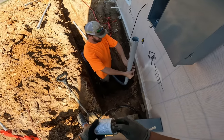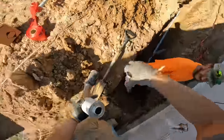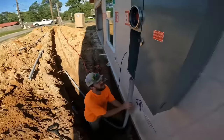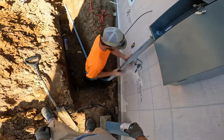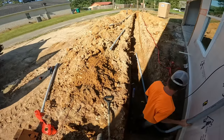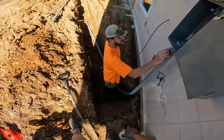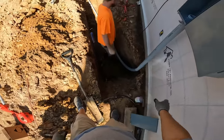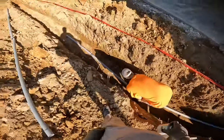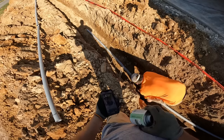Mind you, I know there probably should be a strap on this, but the exterior of the house is not complete. Once they do the siding and get the exterior wall complete, we'll do our final strapping. And another thing — when you're doing the Schedule 80, it's always best to turn your conduit so the inspector or authority having jurisdiction can see it's clearly labeled Schedule 80. Just twist it a little bit or let the green label shine through.